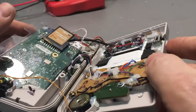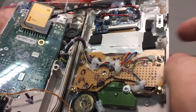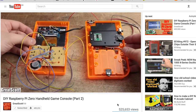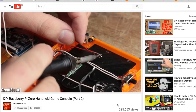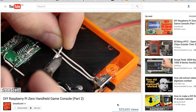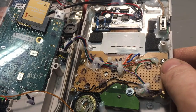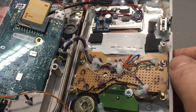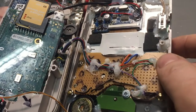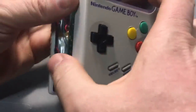I kind of think I came to the nicest solution. If you look at Great Scott's build, he does the same strip board construction but then goes to the GPIO pins of the Raspberry Pi, and I think he's got additional software running to turn those into button pushes. Wormy does it with an Arduino Trinket programmed to interpret the GPIO closures as USB button pushes. They're all methods that work, but using the gutted SNES controller board was the easiest one for me for this first Raspi build.